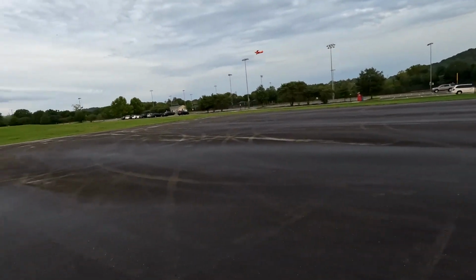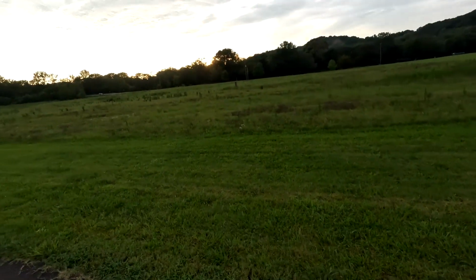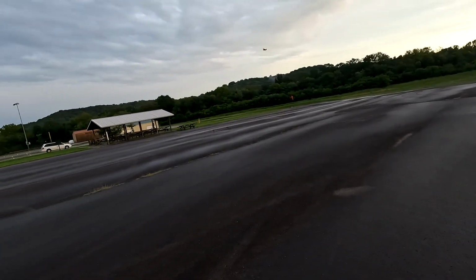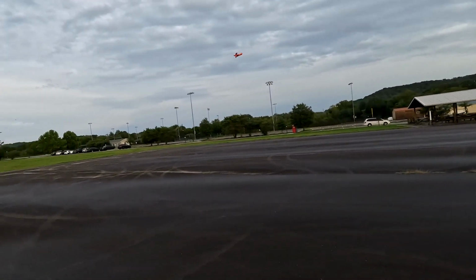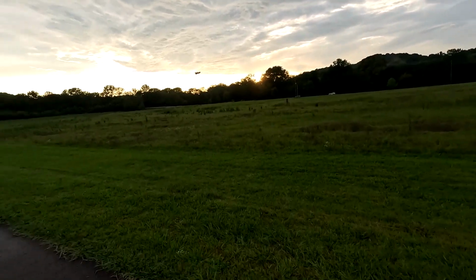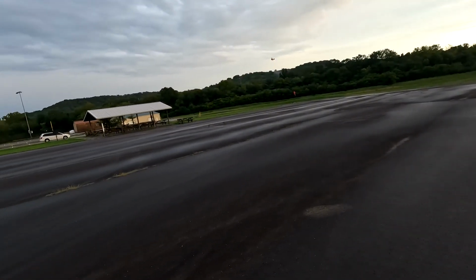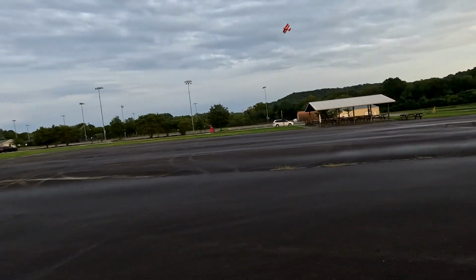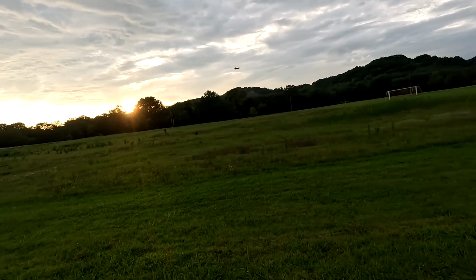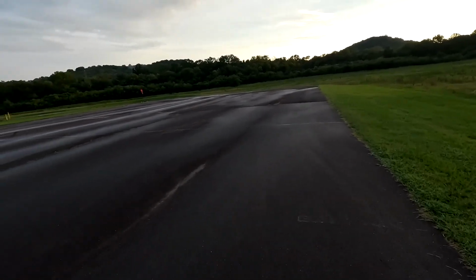They're safe off. Dip down a little bit. 23.4 volts, 60 knots, 109 Fahrenheit. Turn the AS3X gains down a little bit more. I'm gonna do this next pass with safe off and check everything again. It's straightened out now, so. Yeah. Let me do them one more time here. It's nosing down the same with safe off now, so that's good.